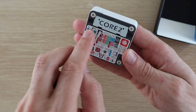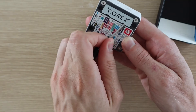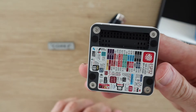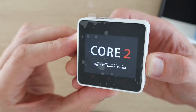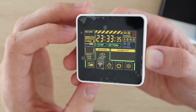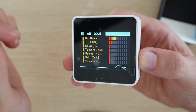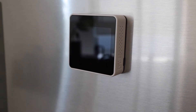Under the case, we've got an LED, microphone, vibration motor, speaker, 6-axis MPU and real-time clock. This cover on the back hides a 30-pin header socket, which allows you to access a range of I/O and communication pins detailed in the diagram alongside it. This port also allows you to plug in other modules to build a stack, which is where the device gets its name. The Core 2 also comes with a basic preloaded program to explore some of the features and sensors. It's also got magnetic feet, so you can easily stick it onto a whiteboard or your fridge as a control panel or dashboard.